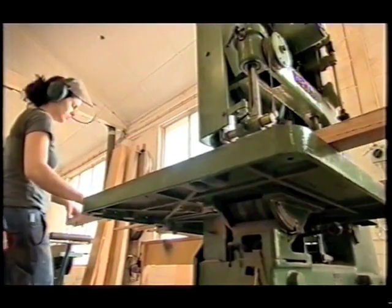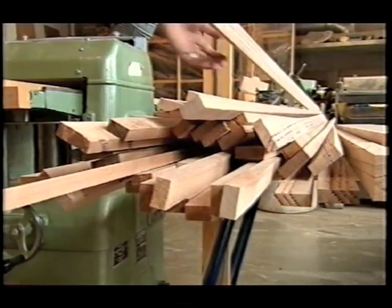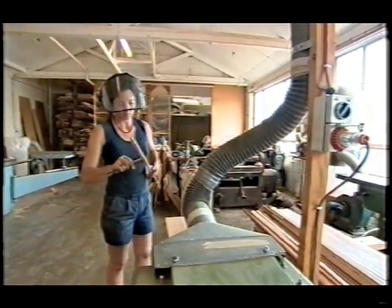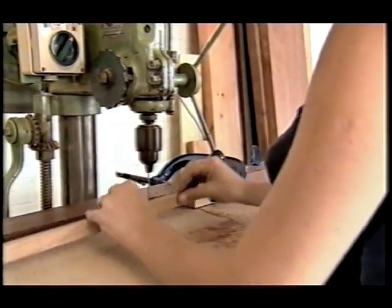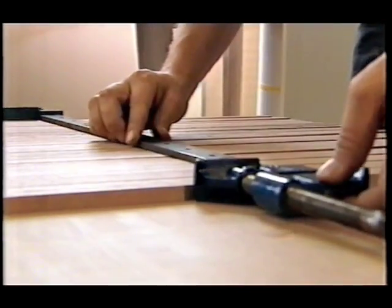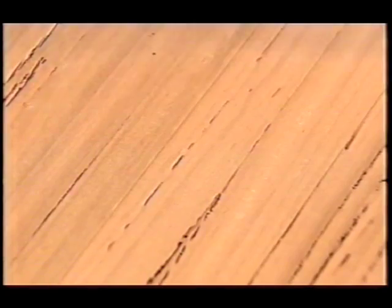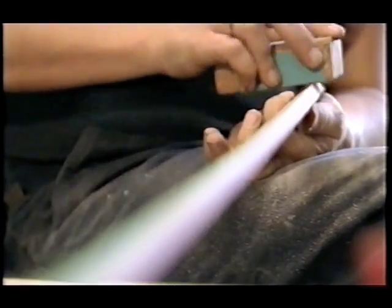After cleaning up and squaring the timber, Laura rips it on the bandsaw into four different widths — these will be the slats for the screen. Each one is then run through the thicknesser to make sure it's exactly 10mm thick and square. Once all the pieces are cut to exactly the same length, she sets up a stop on the drill press and references from one edge to where she wants the first hole to fall — doing the same on every single piece of timber so the holes all line up. It's a few hundred holes later, and now all the pieces are clamped together so they can be sanded. They also have to be arised, which means sanding along their four edges to remove the sharp corners.